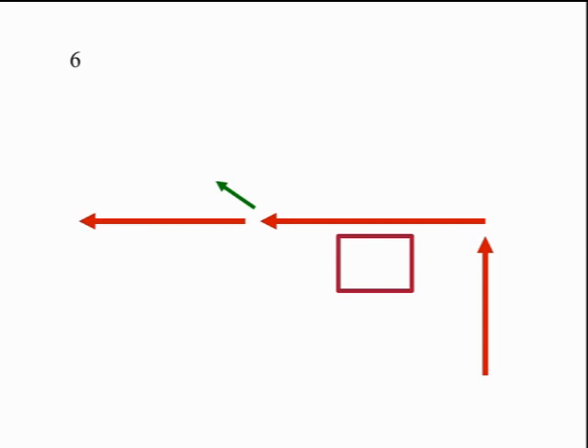Here's the diagram of the video you'll see in just a moment. The green arrow at the bottom points in the direction of maximum signal and minimum noise. We start the hunt, but the house — the brown square — is in the way. I walked about a block in the direction of the red arrow. Past the house, the signal was strongest to the left, so I turned there and continued to walk. About half a block later, the signal is still ahead but to my right. Then the best signal shifted to my right and a bit behind, and I turned and walked in that direction, walking directly toward the strongest signal. Sure enough, I find the transmitter.